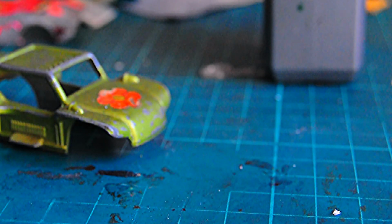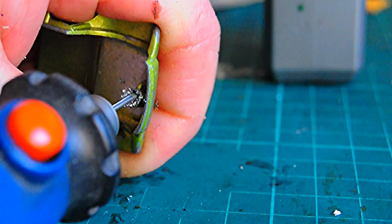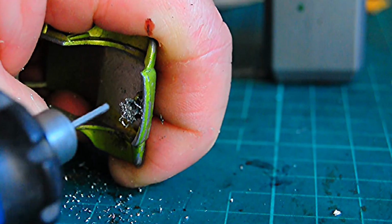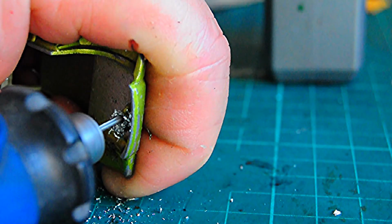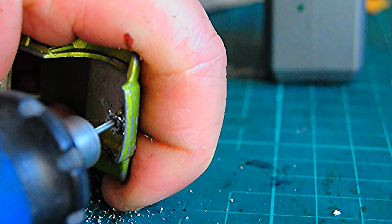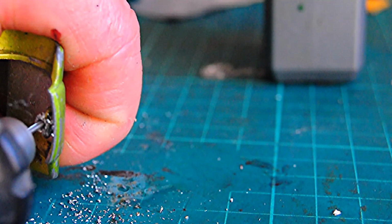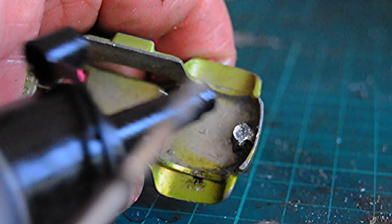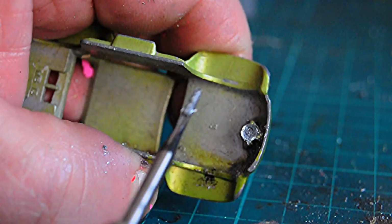And here I'm drilling with a 1.7mm drill bit, so I can use a 2mm tap to put a thread into it. Another way of doing it I'm discovering lately is if you use the screws without tapping, and just securely drive them on, instead of tapping, they will go in. If you've drilled the hole large enough, they will go in, no issue. But it does help if you do the first few threads with a tap to start them off.